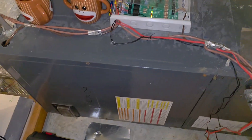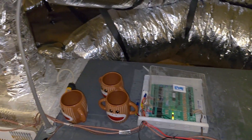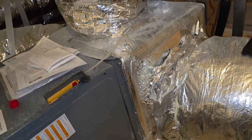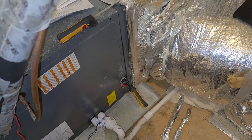Something was definitely wrong with this unit. I noticed super cold air coming out of it, a lot colder than what was normal — air in the low 40s coming out of there. I moved my return sensor to see what kind of air was coming into it, because it's its own system, and I've got air in the 40s coming into it as well.